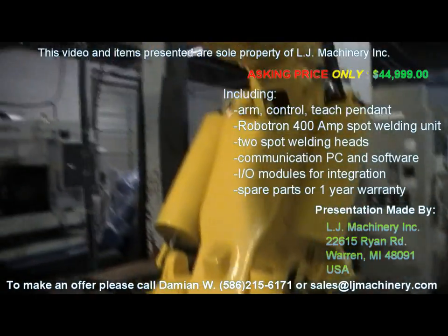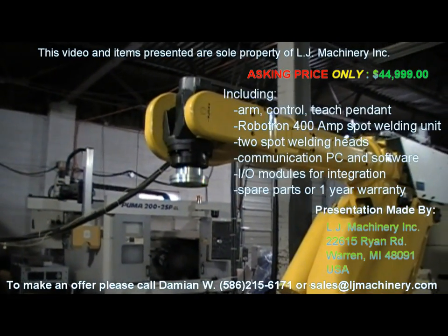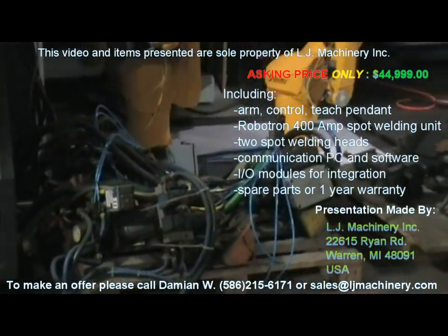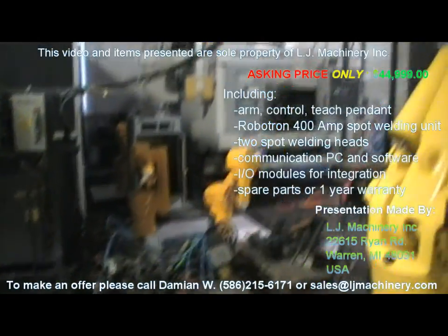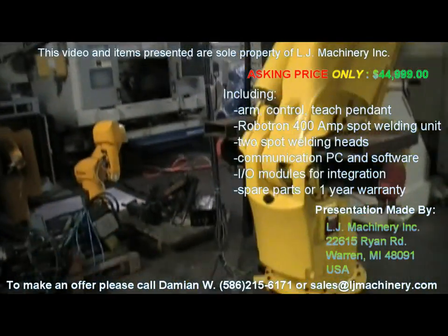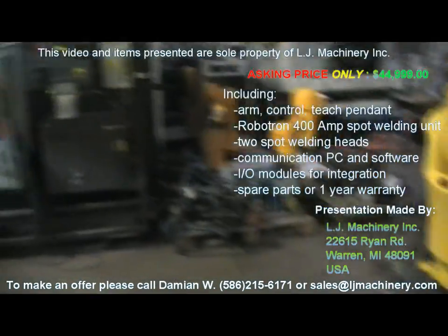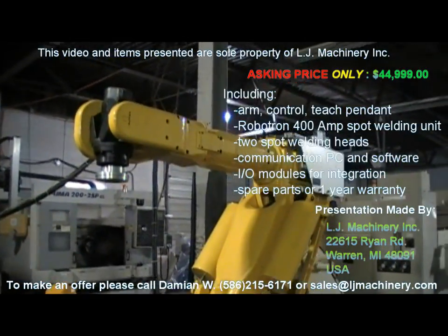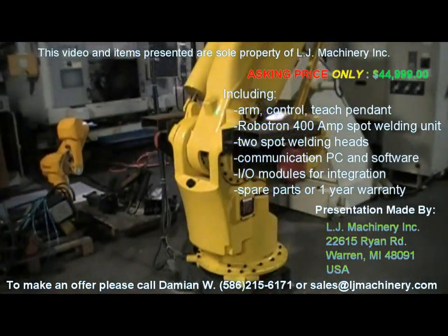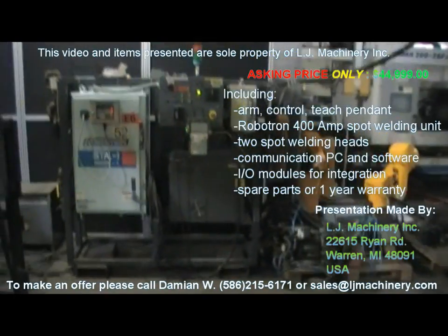The IOs included with this robot are pre-wired, and inside the software is pre-programmed to work with this unit, so it's really an easy hookup to get this unit operational and up and running. The only thing we need to know is what kind of coupling you want and what kind of application you have — that's why we did not put the spot welding heads on, because sometimes customers would like to run the wire from the top, bottom, or from a fixture controlled by PLC or the controller itself.